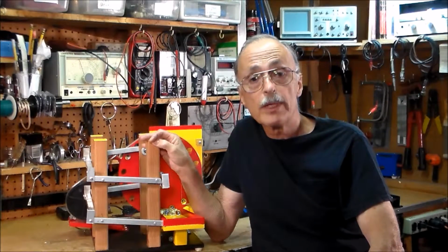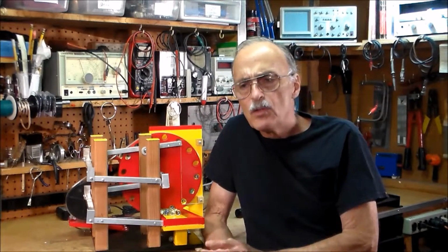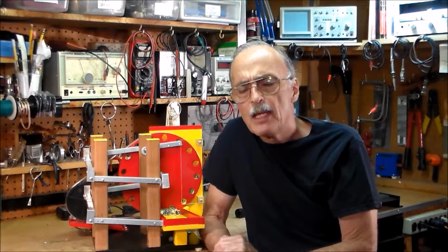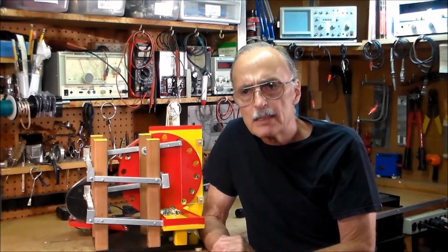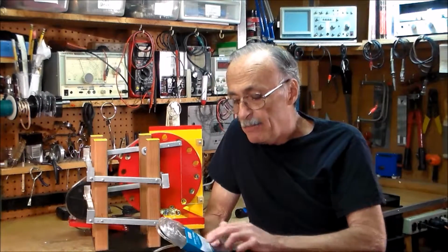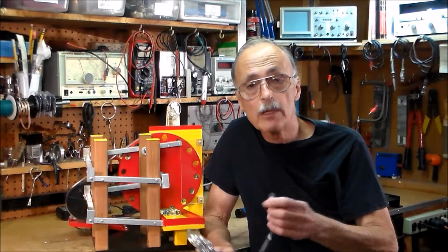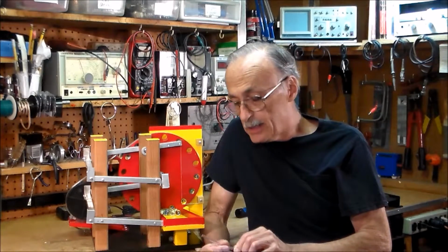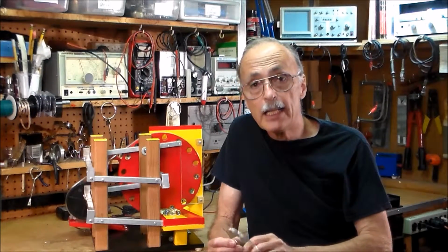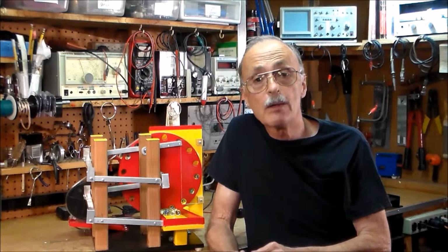So that's my industrial strength marble machine. You'll never see another one like it. One problem I ran into was how to make the pulley drive belts so the motor can turn my lifting wheel. Well, I tried string, rubber bands, shoelaces, anything I could find, and I finally ended up using Petco airline tubing. This is regular aquarium airline tubing you can buy almost anywhere. It produces enough friction against the pulley wheels. It's a little bit stretchable, and it can easily be joined into any length. And the joint is permanent and almost seamless. And I'll show you how I make the joint.